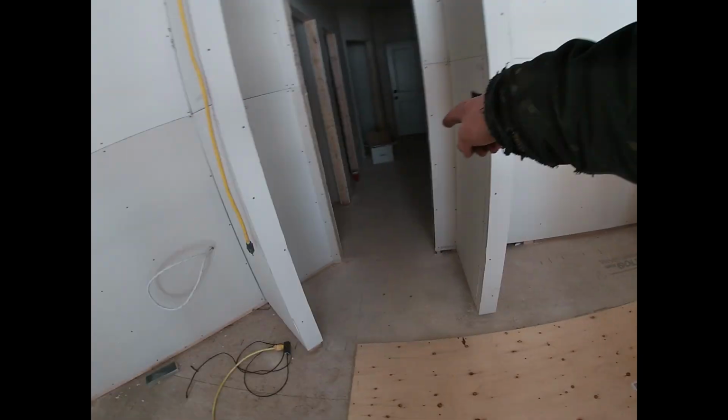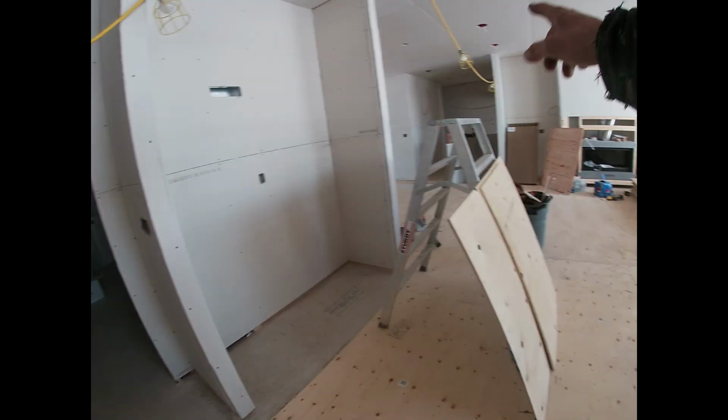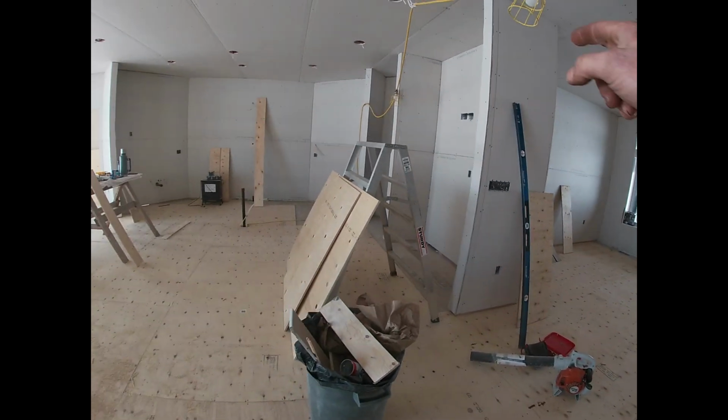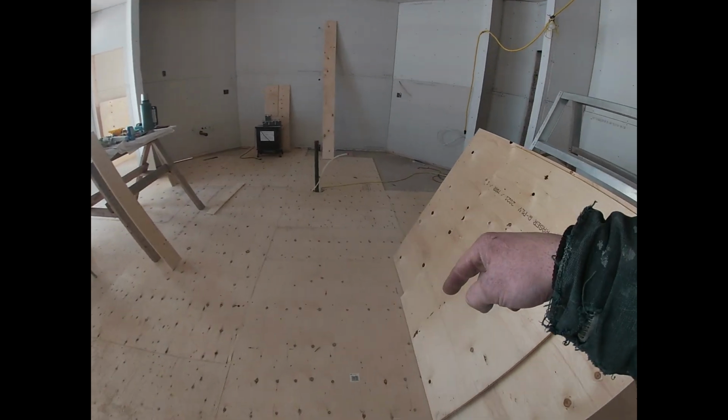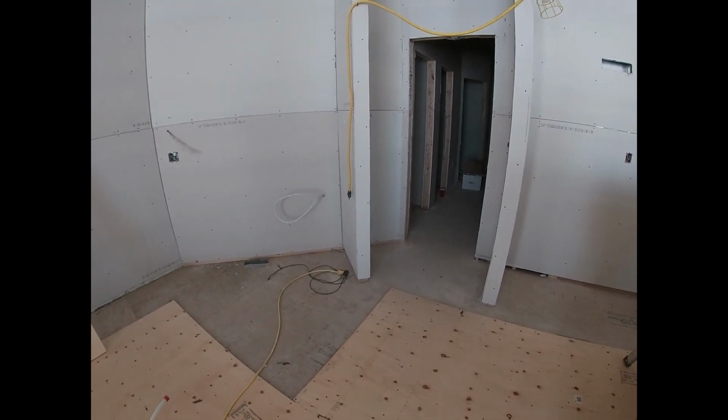It's that we have two different types of flooring. We've got tile in the back and in the bathrooms. And we got this LVP, I think it's called luxury vinyl planks or something. It's the new version of laminate, basically. We're putting that out here. So putting the subfloor on, it's gonna be 3/8 over there and 1/2 inch in here. And then our transitions will be just flat. You won't have a little lip. So it just does a little bit nicer job.